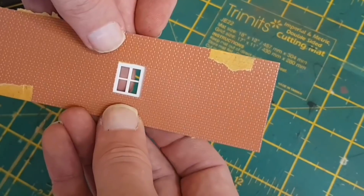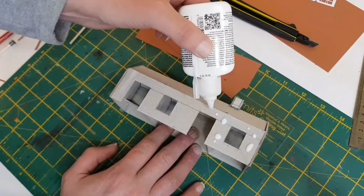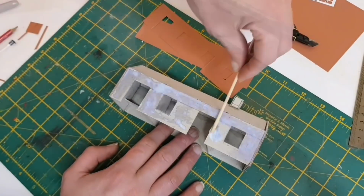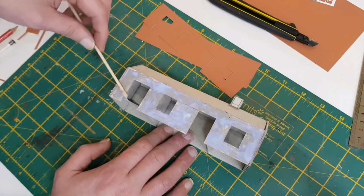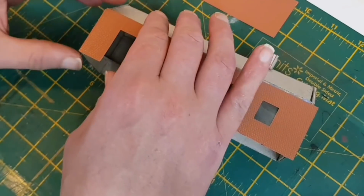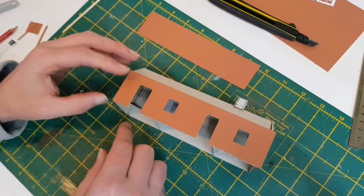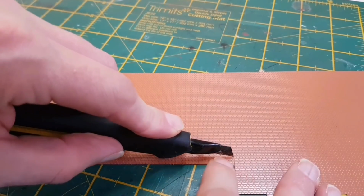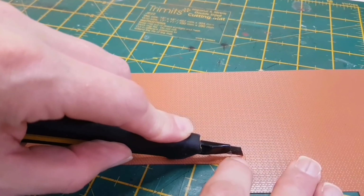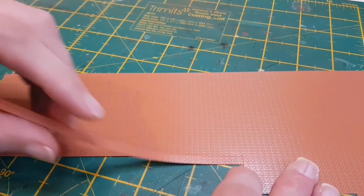Doing this will make sure that the windows sit perfectly behind the brickwork and not fall through the gaps. Several pieces are cut to form the plinth that runs around the base of the building. These are normally anything from 5 to 6 bricks, and then you also want one strip of just one single row.